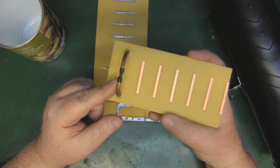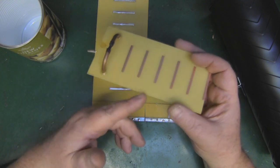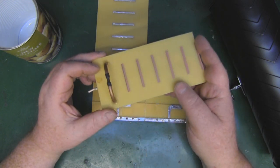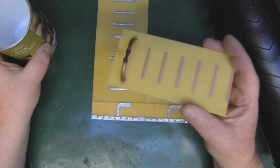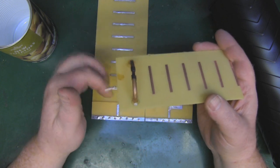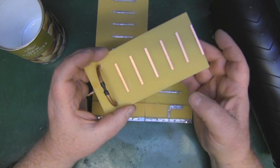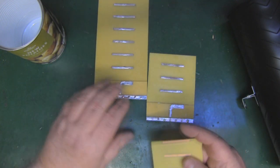I've also tried a different driven element with the Yagi cantenna — one I built recently on this channel using a PCB layout. When operated outside of a can it works perfectly, just as well as building it on box tubing. But as soon as you put it inside a can it stops working. I'm unsure whether it's because the field created by the larger copper element is greater than the waveguide itself, limiting it — but this design does not work inside a waveguide can.